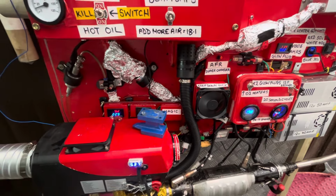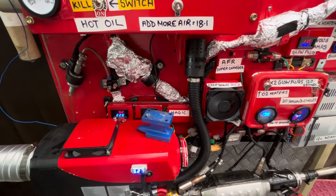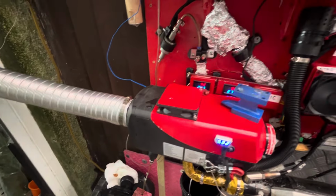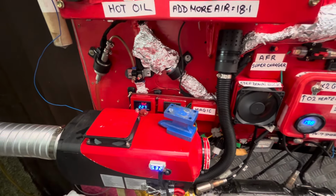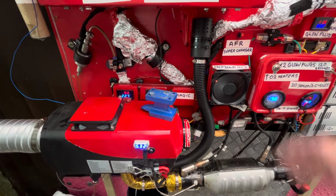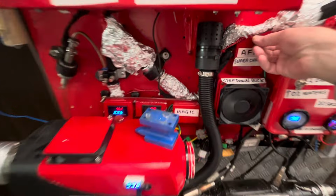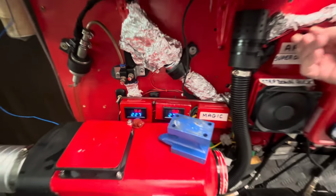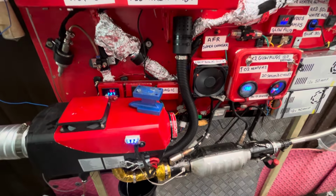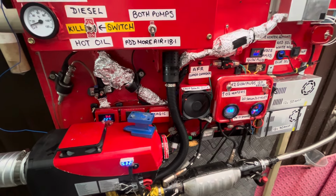And if you're not around it, I've got a supercharger here. Say on setting number 2, setting number 2 is all predetermined, fan speed against 1 pump. You suddenly add 2 pumps in it, then all of a sudden your air to fuel ratio's gone wrong, because the fan speed hasn't picked up. So that's why I have this little supercharger. Can you hear it whizzing at all? It's a ducted fan inside the inlet, so it's ramming the air in there, and it does work really well. I can control it. I haven't got a runaway diesel concept.